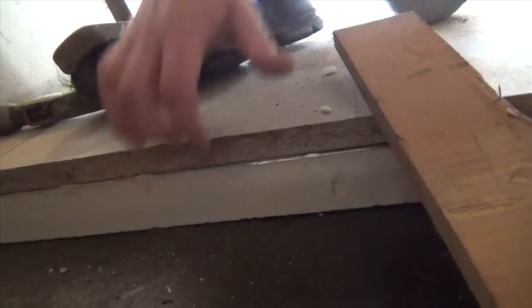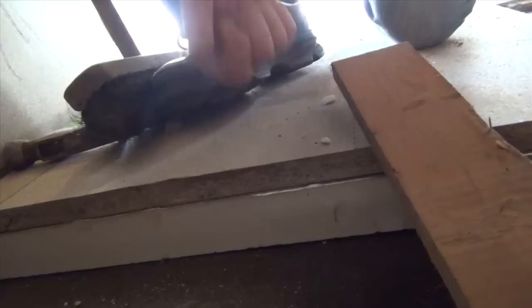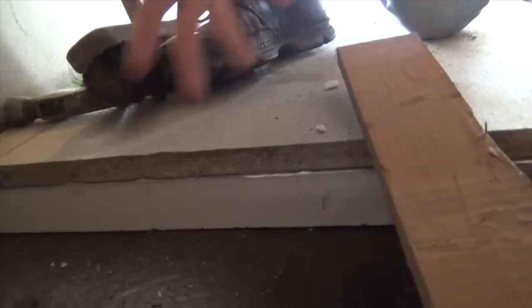In practice that's tricky. Some people float their floors on a thick rubber membrane or rubber feet and then build the internal box of the studio on that floating floor. In here I haven't done that. What we have — you can see — is about two inches of foam insulation going on to the bitumen and the concrete that's going to make the floor. That's excellent thermal insulation as required by the regs, and it's actually going to be pretty good acoustic insulation as well — it's going to really deaden down this floor quite a bit and prevent quite a lot of traffic noise and footstep noise from elsewhere.